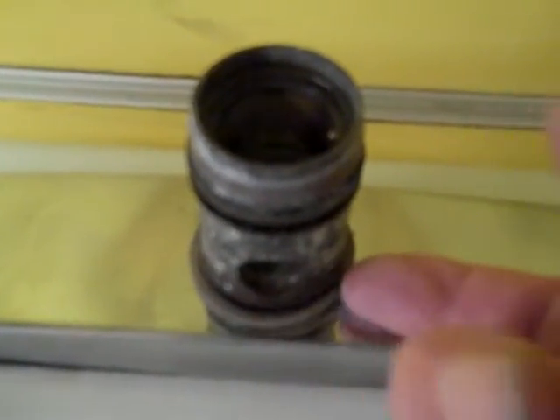Now there are the two big O-rings that come in the kit. We're going to replace those, but first we need to clean it up a bit — that's always a good idea. Now that we've got it cleaned up, we can start installing our O-rings. First, make sure that you have this spacer at the bottom — it's a little plastic spacer that just helps your unit glide easier without grinding metal. This is not included in the kit, so don't break it. You could probably buy it at Home Depot.